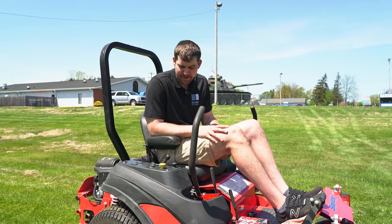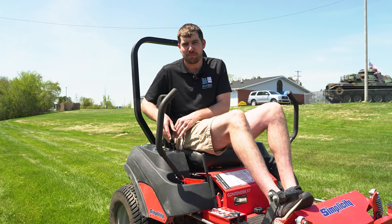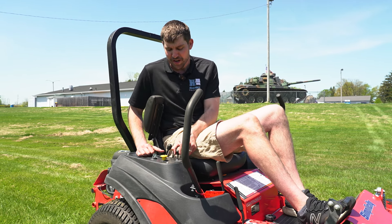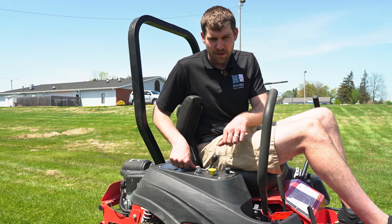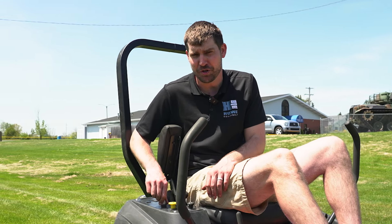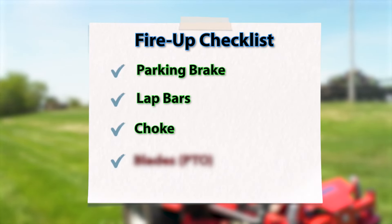Some models you don't need to be sitting on the seat. Most of the mowers you're probably going to come across are going to be carbureted. How do you know if it's carbureted? It's going to have a choke right here. Some chokes are a separate thing that you can pull up on like this; other ones will have a little extra lever you can press forward and then pull back. Typically for a cold engine, this will have to be choked. Once it fires up, I want to press this down as fast as I can. If I try to start without the choke, notice that this one doesn't start. Most will need it. Once this is really warmed up, you will not need to choke it.